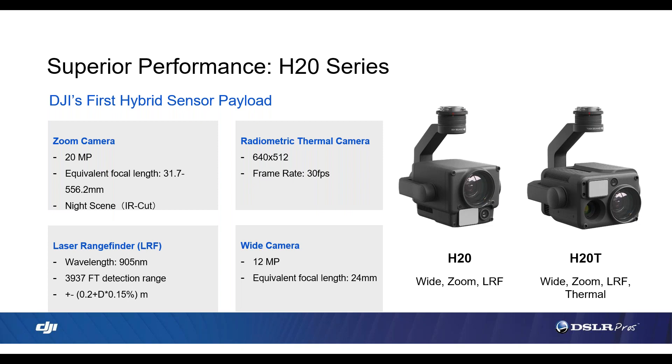Next, we're looking at the H20T, which is the same as the H20 but also has a thermal camera. This is a 640-resolution, 30 frames per second radiometric sensor with a 13mm lens — very similar specs to the XT1 or XT2, which were the previous flagship thermal cameras. Radiometric refers to the ability to extract and store temperature data from every pixel in the image, rather than just viewing the thermal image on the monitor. This is really important on the industrial side for storing, referencing, and reporting that data. Some entry-level drones like the Mavic 2 Dual don't have the ability to store radiometric data — this is something you only see in the XT1, XT2, or H20T.